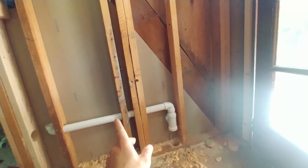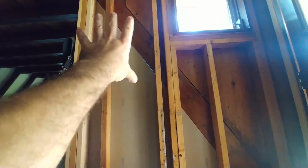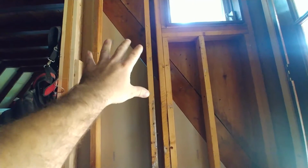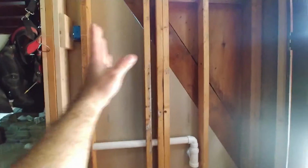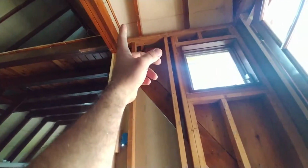Anyway, we rolled down, we bent over. Now I just wanted to go over here and get out from underneath the window and go up and go out, but I forgot the panel is going to be here, and a panel is 14 inches roundabout, 14 1/4, whatever a bay is wide, almost like a vanity, to fit into a conventional wall bay. So this whole space is going to be unavailable to us to go up. So I had to go even farther and turn and go up here to vent out.